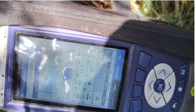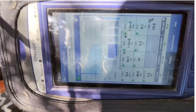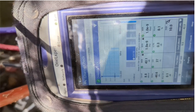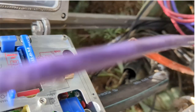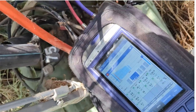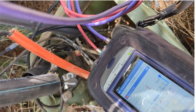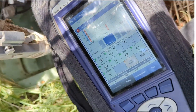So currently — I'm at 8.9 and I want it about 13. I'm going to add 5 dB, so to do that I'm going to take that 16 pad out and put an 11 pad in. Signal's going to drop a bit — pad it and come back. Now we're coming out at about that 35 that I wanted.